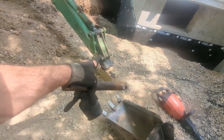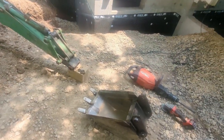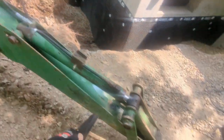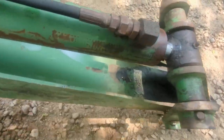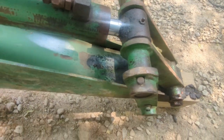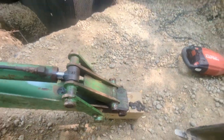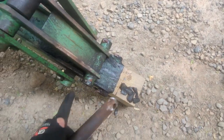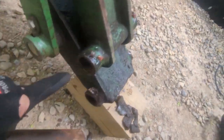And I don't know why we got all that moisture. It's all oil there, but up where the last place where it would be coming from is relatively dry. That's an interesting question. Anyway, now I'm going to pop these four Zerks out, replace those, and make sure the new ones have got grease squirting down in there. This is the issue here.